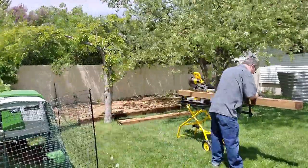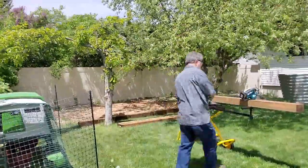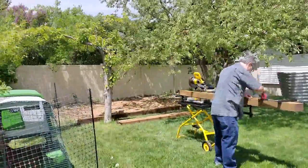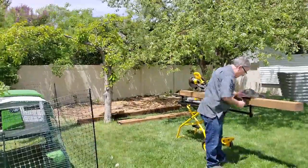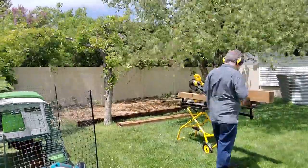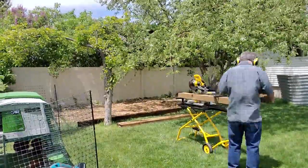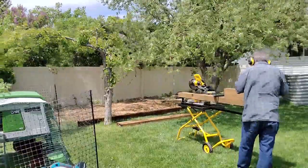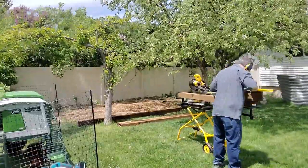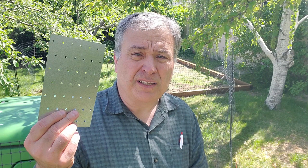You can see I have one of the 10-foot 4x6s laid up on my miter saw stand. I'm cutting them to length because I needed 18 feet between the two of them. I was going to do what they call a half-lap joint — when you're butting two pieces of lumber together, a half-lap joint is supposed to be a really strong way to join two boards. But I didn't have the right saw for that, so I bought metal plates to put over the end of each board. You can see one of those plates screwed there where the 4x6s are joined together.